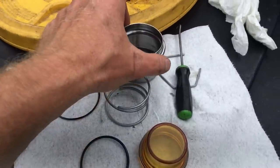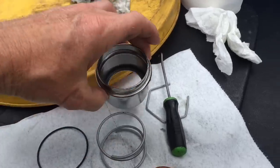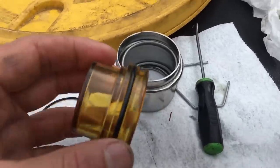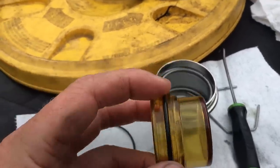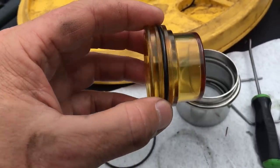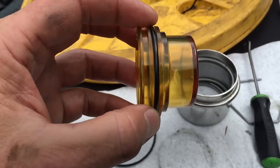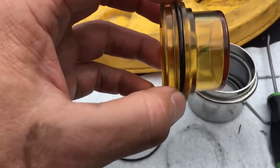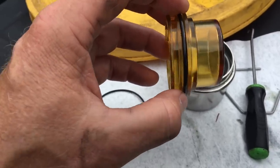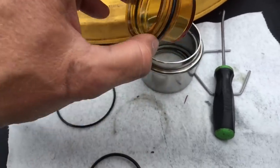These are the major components in the hub and the oil bath. This is the main casing — it's a 2.3-inch size on the outer diameter. This is the spring that goes inside, and this is the little glass or plastic tip that goes on the inside through which we can see the oil level. These are supposed to move in and out with any pressure changes inside the cavity. It's recommended to get every bit of air out to minimize movement from expansion and contraction of the fluid — air is far more dramatic in terms of expansion and contraction.